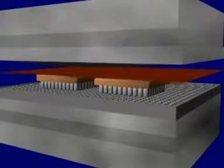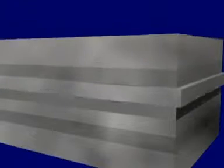In direct full surface contact to the membrane, it is heated up to the required lamination temperature. Using air pressure from the top, combined with vacuum from the bottom side, the foil is then adapted to the contours of the workpiece.